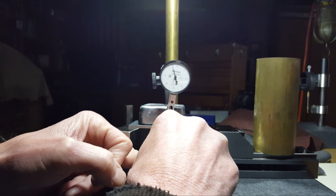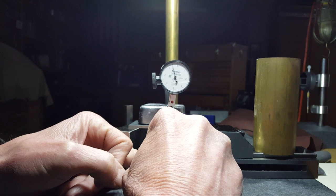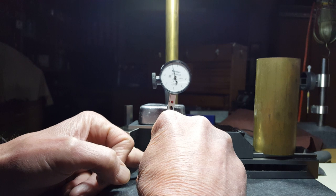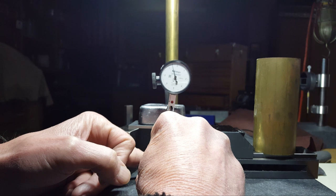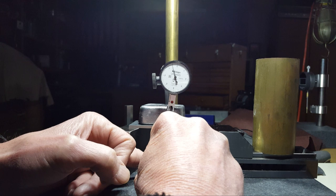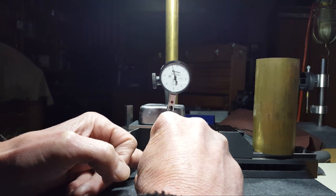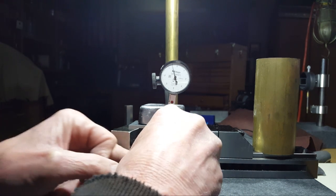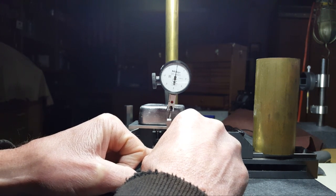All right, so slide it on the table first to make sure. Yeah, the granite surface is completely cleaned. Everything cleaned down, because trying to measure tenths is ridiculous. So I'm not even touching. I don't know why it's not touching. So I've got to push kind of hard here. There, I'm starting to get a reading. So there's 1, 2, yeah, I'm getting the same reading. Back it way out, go back in, flip it around, see where this side is. This is a hard one to hold down on the surface.